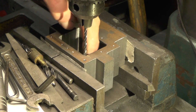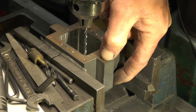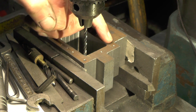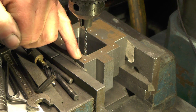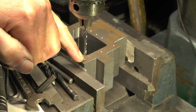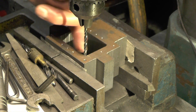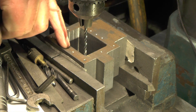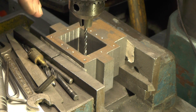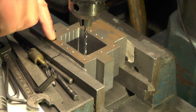Now I've got that centre portion milled out in both the valve chests. I've got to put 10 holes in for the fixing holes to the cylinders. They're 5/32nd holes but I'm going to be drilling 1/8th to start with, then I can use the steam chest as a template on my cylinders to mark the holes off. Once I've got that done I can open these up to 5/32nd clearance for 4BA screws.